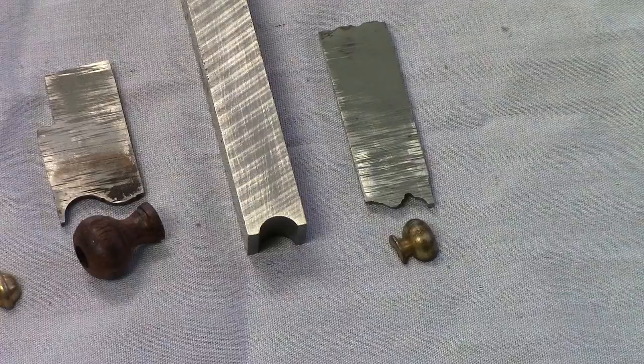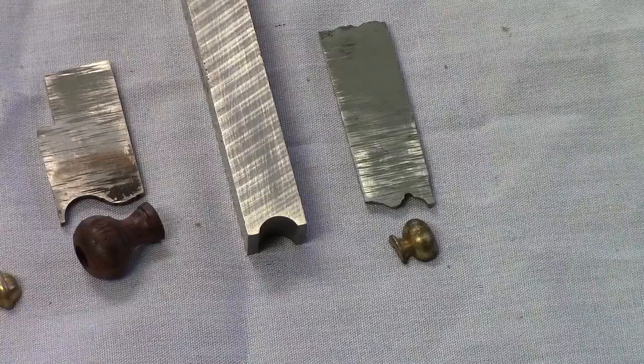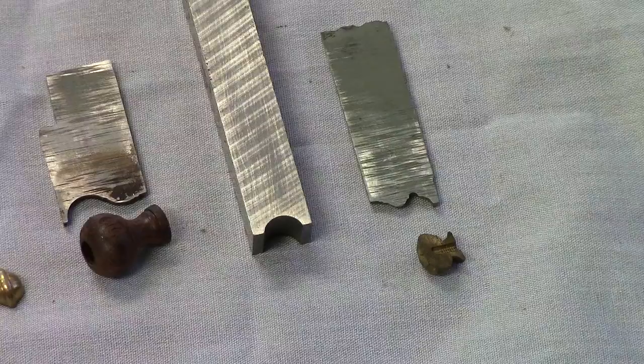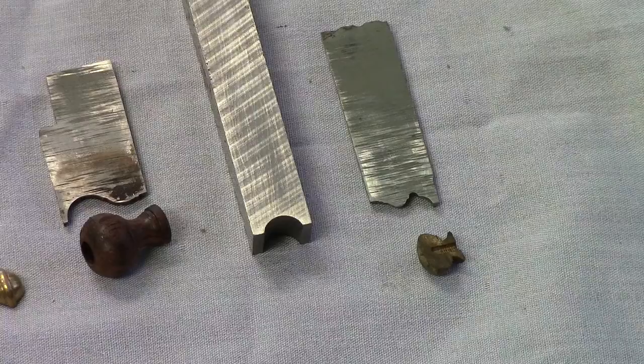Once I'm satisfied with the finished profile, I will saw it in half, as the brass profile in front of the cutter is, you see it, it's just sliced in half. And once I get this cut in half, I will put layout dye on my tool blank, whether it's high speed steel, hacksaw blade, or whatever stock I'm making the cutter out of, and I will scratch in the profile on the layout dye,